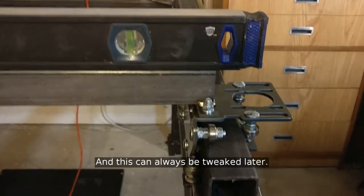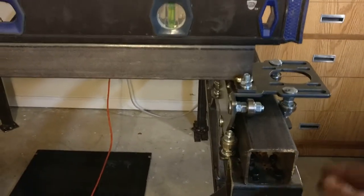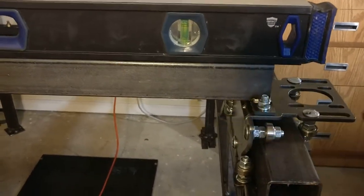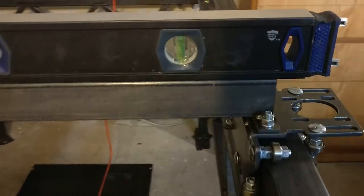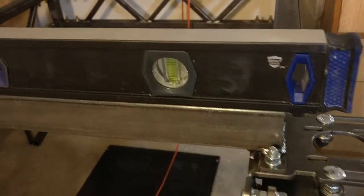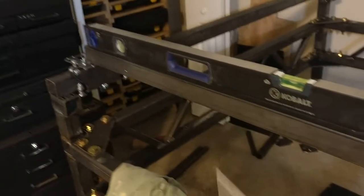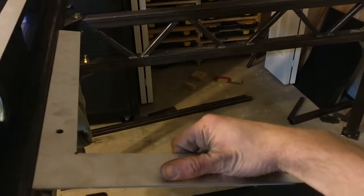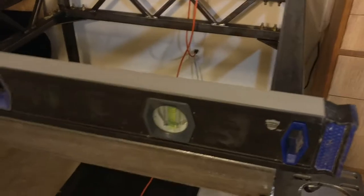I put the x-axis here in the middle of their slot range with the nuts still loose, and the y-tabs in the middle of their slot range as well. That way when the actual gantries are cut to length and welded in place, I'd have the maximum amount of adjustability left in the system. From there it was really a case of precision eyeballing — is this rail here roughly level with that rail there, and is the actual gantry roughly square to them as well? It's kind of tough using a big carpenter's square when things aren't actually all in the same plane, but if you make some mistakes, that's the reason for having all these bolts — you can make up for it later.